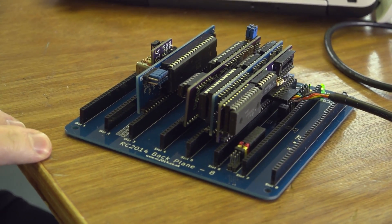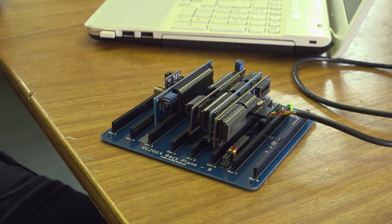Cut and paste rather than typing out character by character? That's right, yes. Though if you still want to type character by character, you can. The key thing I decided to do with this was modularise everything into its own individual basic component, and it all runs on a passive backplane. The backplane does nothing other than join the parts together — so it's a bit like a more complicated breadboard, essentially.